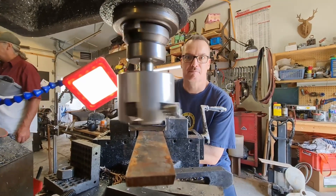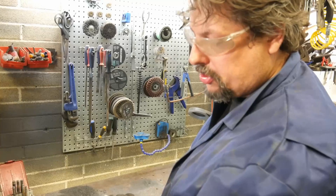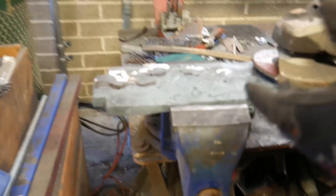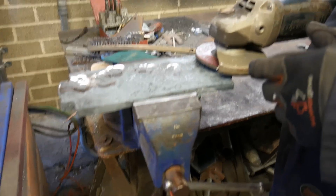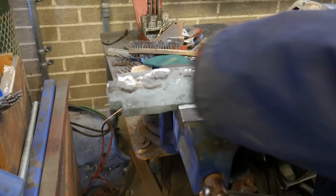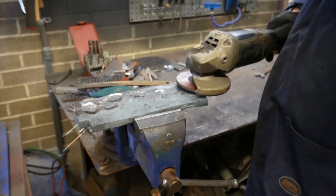This is serious work. We're going to put this on the mill to shave off the mild steel that's around it and get it down to size. We're going to use carbide cutters, but carbide cutters do not necessarily like cutting through the scale we've got here. So I'm going to use the grinder first, just to get through all the scale.